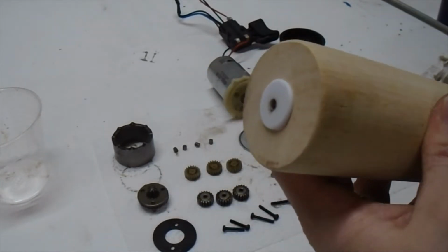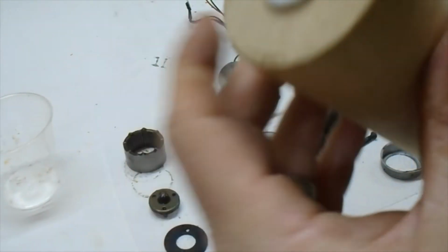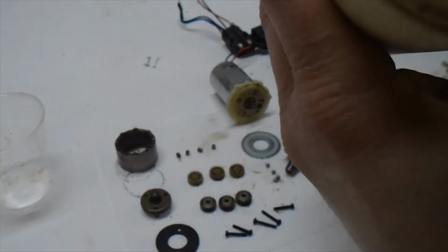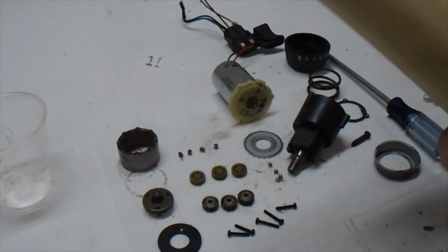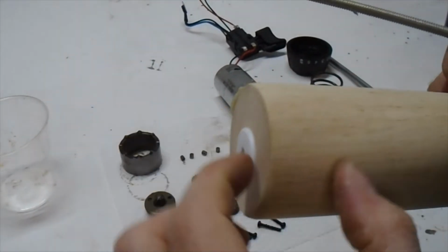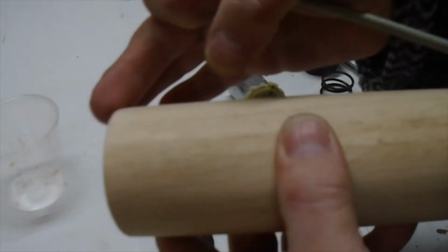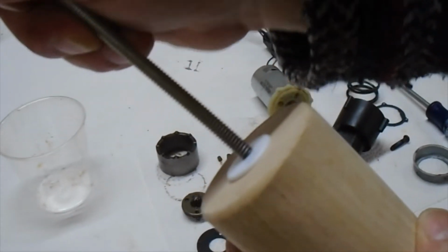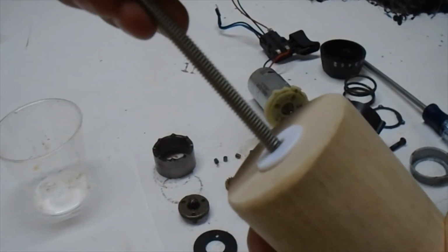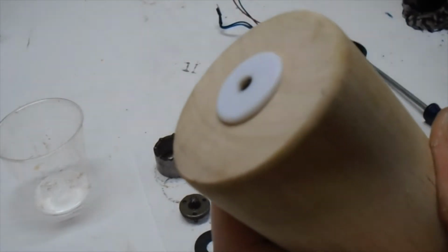Try and keep this in frame here. So there's a rolling pin with the handles and the rod removed. And it just spins freely in these plastic shims here. In fact, well, they pop out. They don't go in very far. They're just a shim on the end that goes in. And the bore in the side of this is all the way through. But then I can take a quarter inch thread, and it actually threads into those pretty good without stripping out.